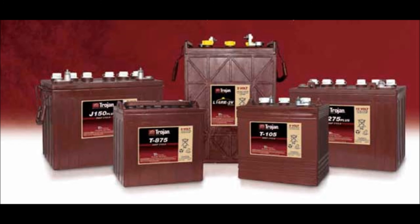The last thing that we're going to talk about is battery storage and the temperature of the batteries. Ideally, you want the batteries to be about 77 degrees Fahrenheit for optimum performance. Any higher than that and you're going to shorten the life of the batteries, and any lower than that and you won't have as much power storage. Making sure that you're not exposing your batteries to extremes in temperature is very critical in getting the most out of your power system.